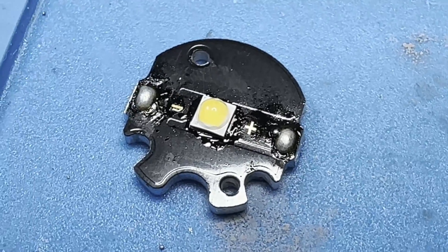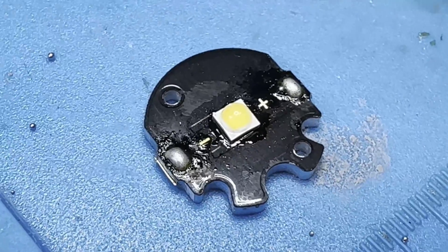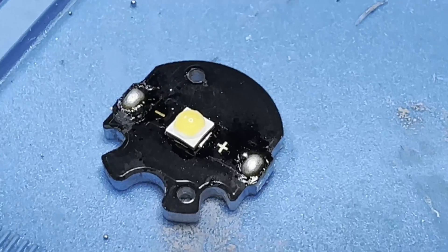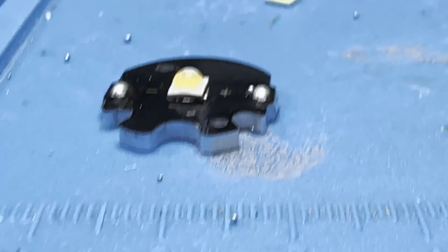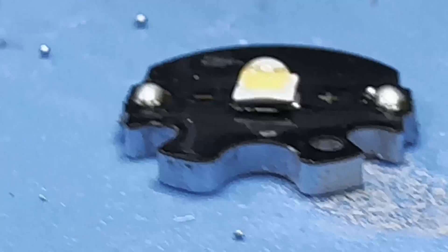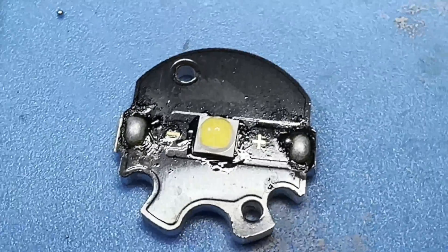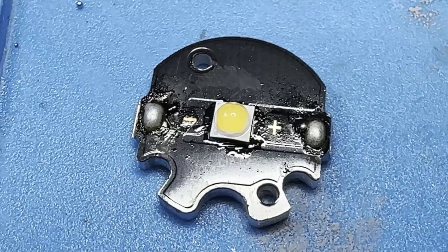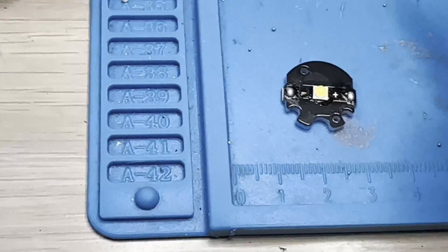This is not a beginner's class — I'm expecting you've already got an idea, so check out one of my beginning videos on emitter swaps if you want. On the left side where the negative is, I finally got it covered up and centered pretty good. On the right side with the plus, it's showing a little bit — that's just the way it's going to be. You can see it's a little crooked, not quite square, and a little lifted on the right. This is a 35x35 going on a 37x37 pad — that's why you use a little more solder paste than you intend to, and it will make connection.